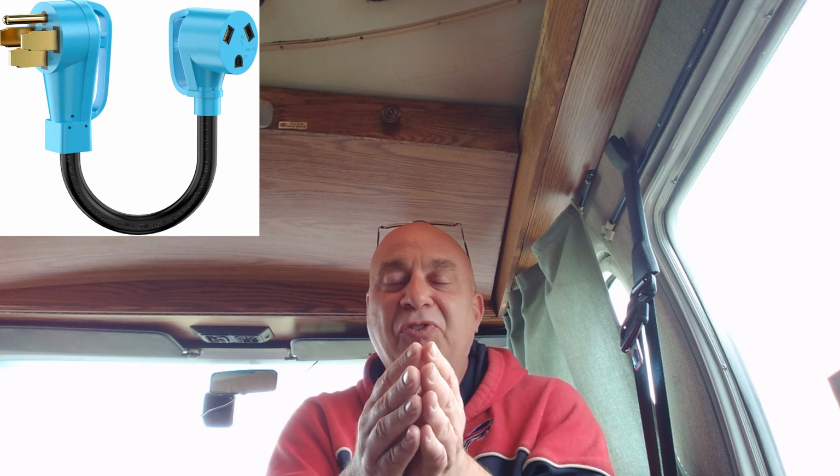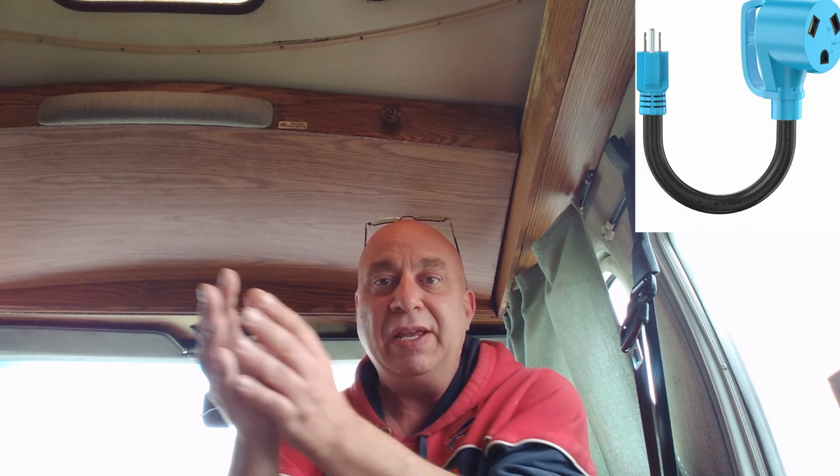So what you want to be able to do, like in my situation with this large van with the 30 amp hookup, I want to have an adapter so I can go from 30 to 50. And I also want an adapter so I can step down and go from 30 to 15, just in case I'm somewhere, and that situation is pretty much going to be if I'm at a friend's house somewhere, driveway camping for the night, whatever, I can run an extension cord and plug into whatever they have. So you want to be able to do that.